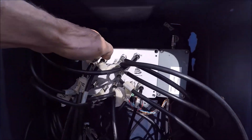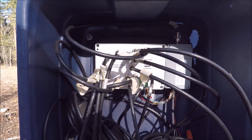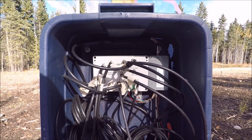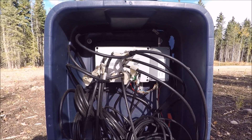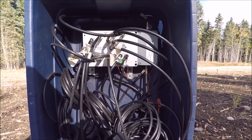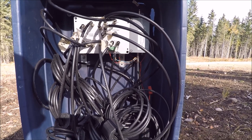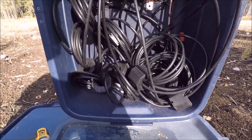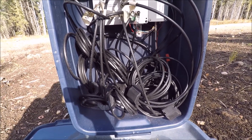The control box itself is shown in white here. It combines, at any one time, three of the elements, and it's very well documented on the DX Engineering website. This array from the Yankee Clipper Contest Club is just a fabulous array and I've been very happy with it. The receive combiner is controlled with Cat5 control lines for the switching. Each vertical also has a Type 31 clamp-on big ferrite toroid on each line to remove and eliminate any common-mode noise on the outside of the coax.